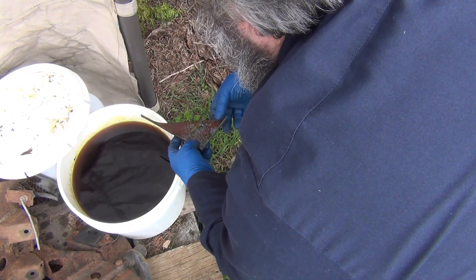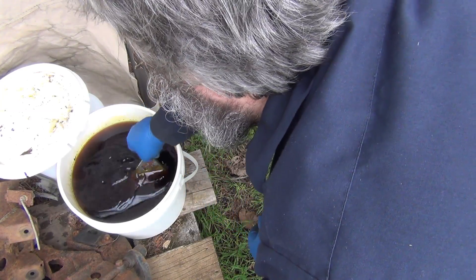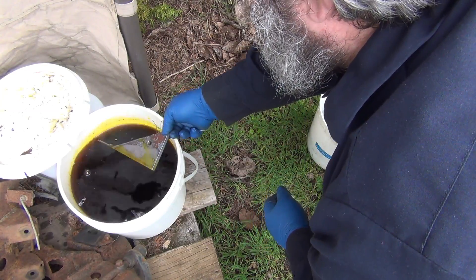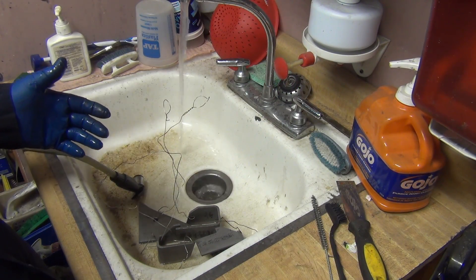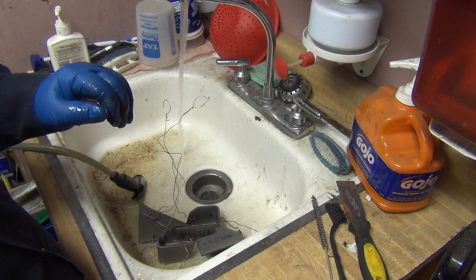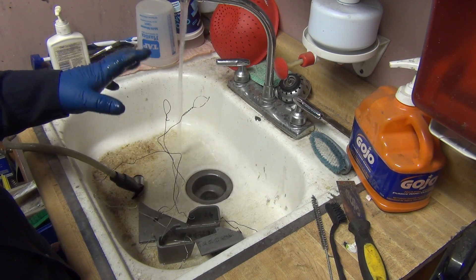This side had rust and everything — nice! That's how you deal with mill scale. I like to do it in hot water because then when you blow it off it dries and evaporates a whole lot quicker, and it's a lot easier to keep it from leaving too much flash rust.